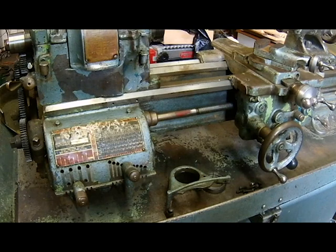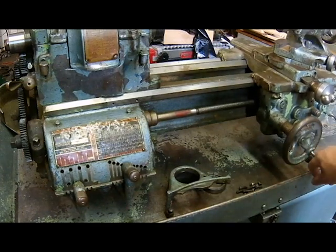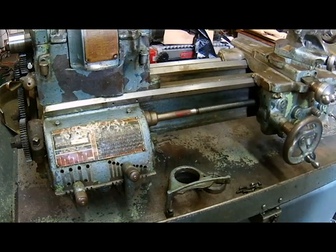It has the large bore for the 5C collets. The major issue with this lathe is the condition of the bed — there's fairly large wear in the ways. It's not a hardened bed, so my thought is I'd like to take it apart and have the bed ground. I want to learn about the grinding process, the scraping process, refitting the parts, and making a very accurate machine out of a used machine like this.